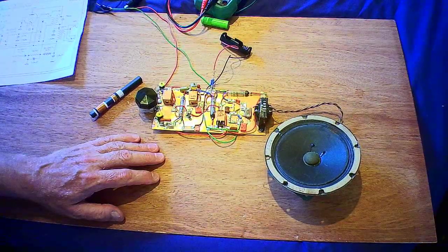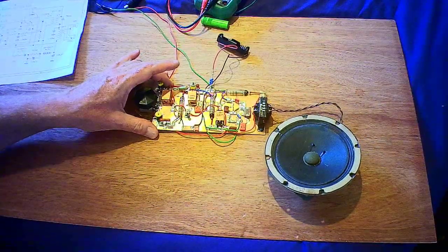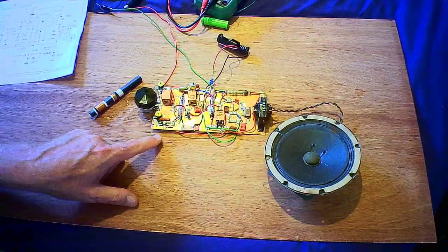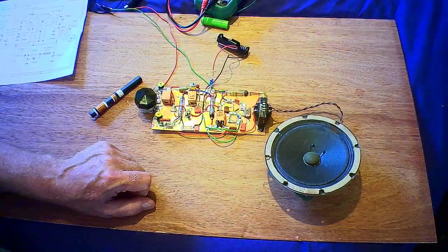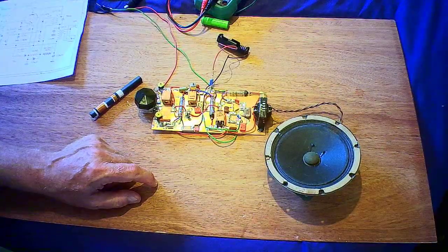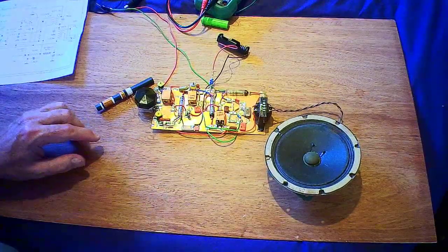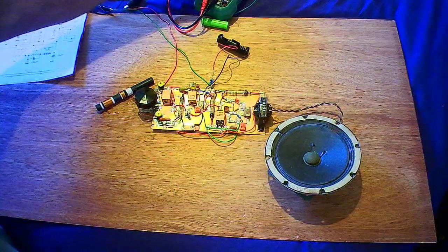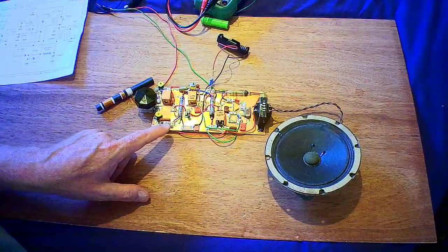It means there's fewer wires coming out of the valves. It's easy to lay out, especially when you're using this sort of technique, which is basically single-sided copper clad board, not Veroboard. I cut little rectangles of double-sided PCB and then solder them to the board where I need tracks or pads to join things. Oops, that's my meter about to time out.